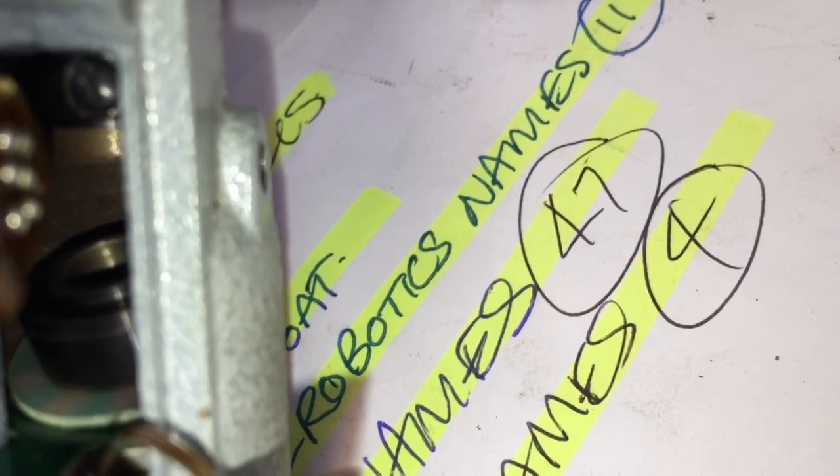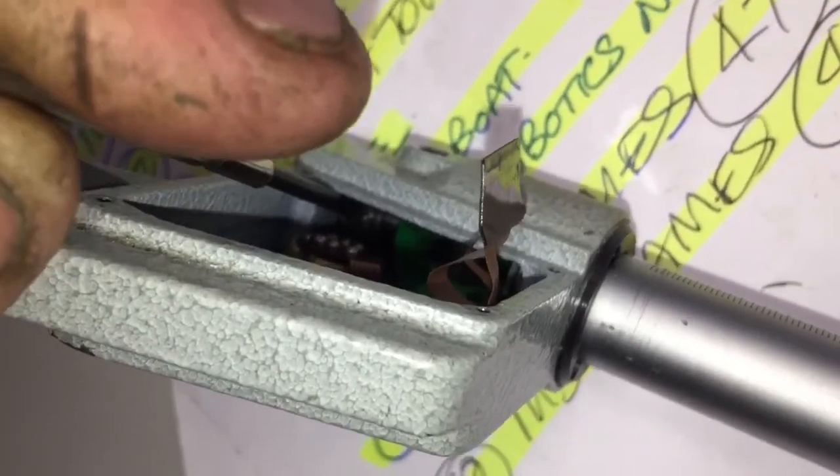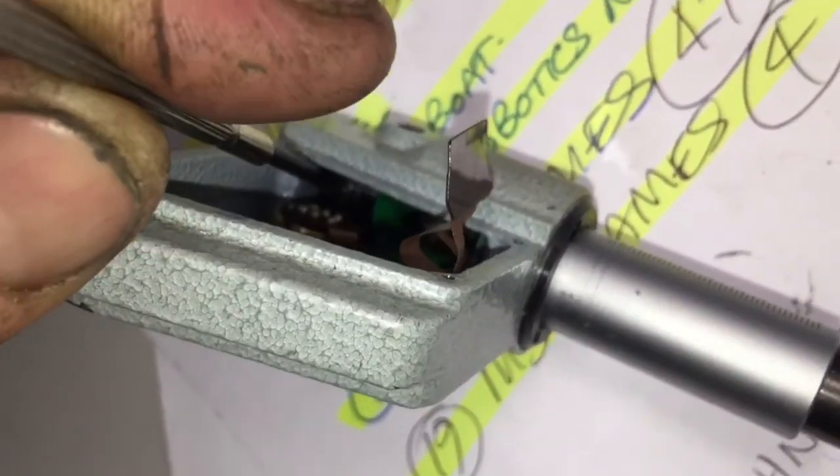That's set to holding a barrel and a spring, and when those are released, I believe taking the backlash out of the assembly would be done using this. Release the spring, allow it to tighten up on the shaft, then tighten it back down again to lock the shaft to length.